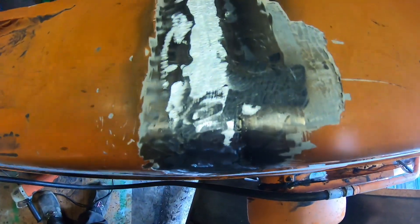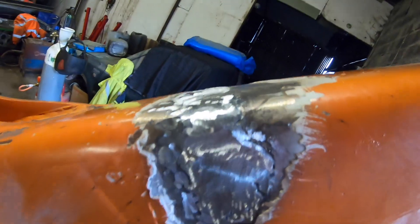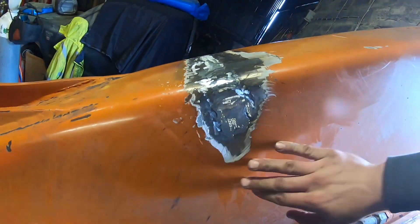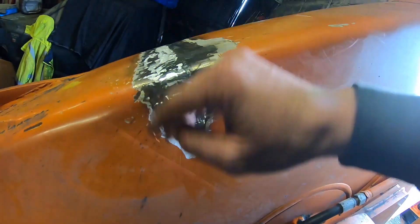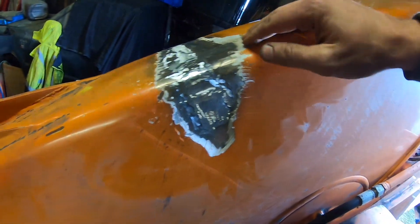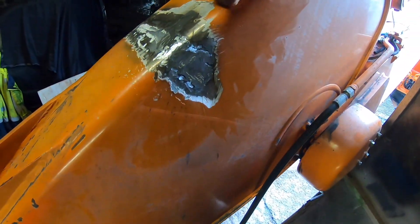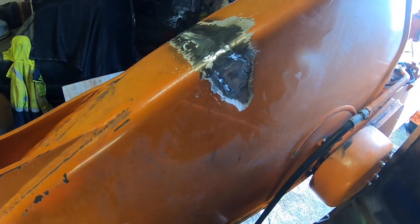That's all ground up, it's all pretty flush — just tiny tiny raised areas in the middle left, kind of the bridge of weld to hold. I'm happy enough with that. As you can see, fillers were used here before to tidy this up, so I'm just going to use another little bit, patch it across, fill it up, give it a wee run of the sander. That'll do. Give it a bit of paint — I have to get a little bit of a touch-up can of orange, but I'll give it a little bit of primer for now, seal it up as best I can. That's it.